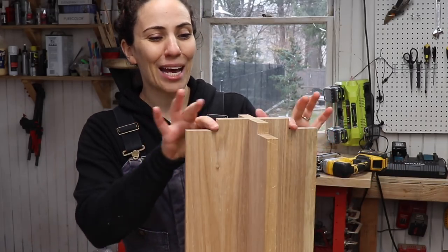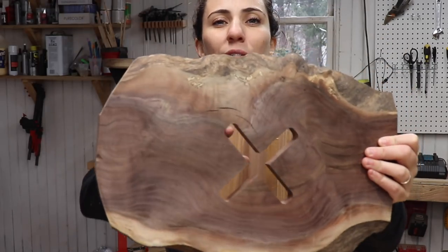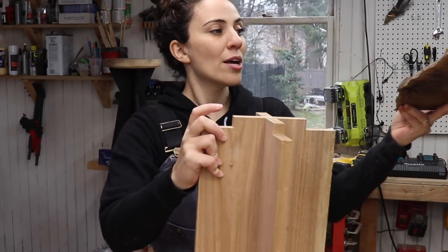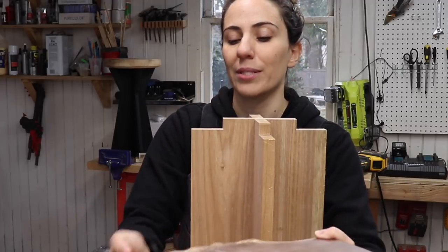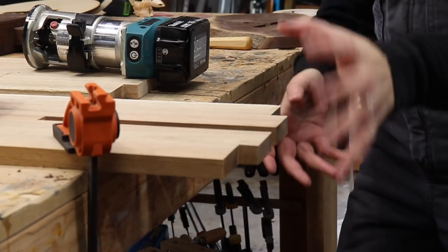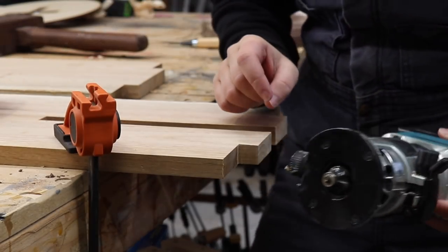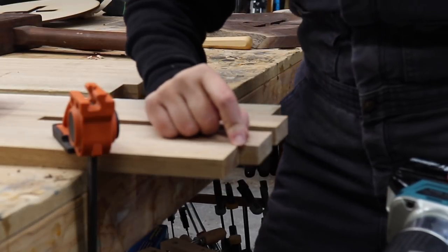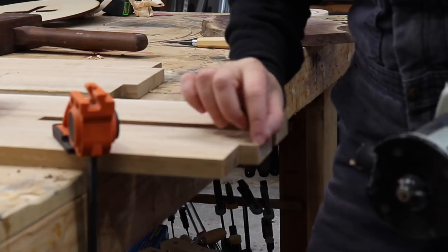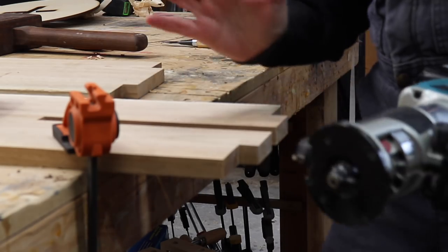Everything is fitting really nicely now and all the corners are squared up. Just one last thing to do — the X mortise corners are rounded from the router bit, so it can't fit onto here because these corners are square. You can make these square if you want, but I think it's easier to make the tenons round. You can round them over using chisels and files or rasps, but I find it's easiest to use a round over bit that has the same radius as the flush trim bit. Just be careful to get the tenons only and not the top of the actual base, unless that's the look you're going for.